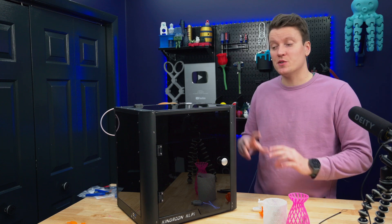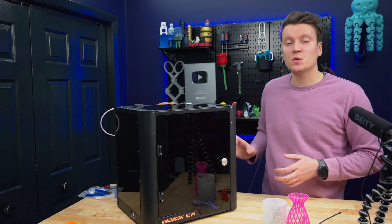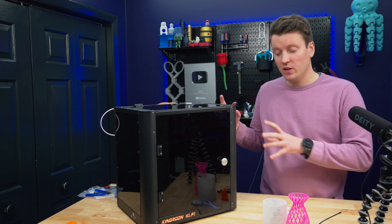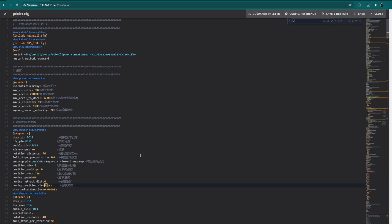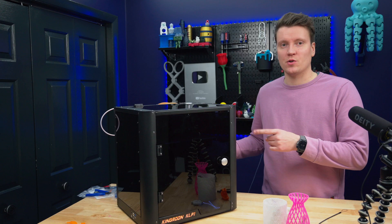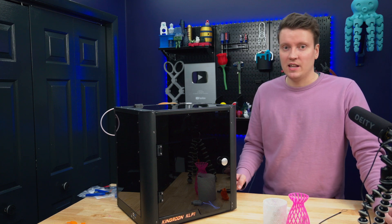Another mechanical design element that will need to be upgraded is the fans. There's a reason I haven't had this printer on while talking. There's a power supply fan and an extra fan cooling the control board underneath, set to turn on at around 30 degrees Celsius. For my testing, I changed that inside Klipper's config file to about 40 degrees Celsius so it won't kick on that loud fan while sitting idle. It would be really easy to swap it out with a higher quality Noctua fan or really just any better fan — it's going to be a lot quieter than this one.